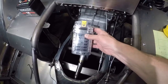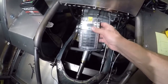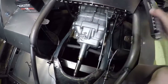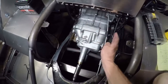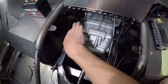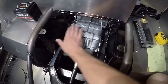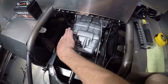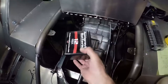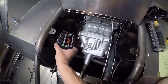I've taken measurements of my fuse block — that's what's going to determine how wide it is. I've made it just wide enough to handle the fuse block with about an inch and a half on each end. And then I've made it wide enough in the other direction so that it just clears the transaxle before it takes an angle down for the batteries. It's going to have a flat section in the middle, then taper down with an area on each side for the batteries to sit into, and those will have foam packed around them to protect them.